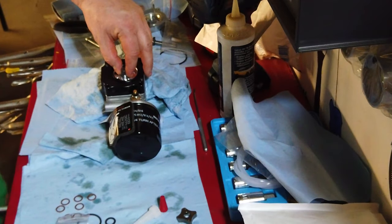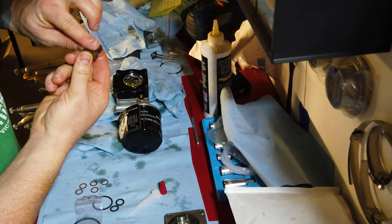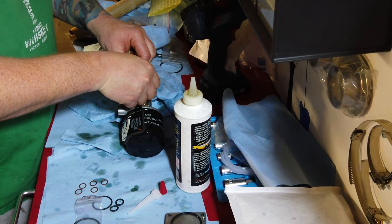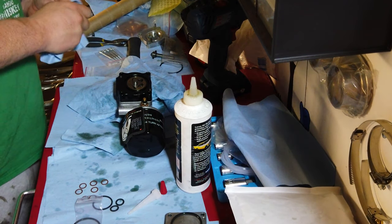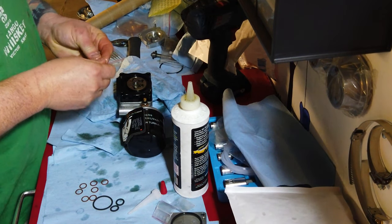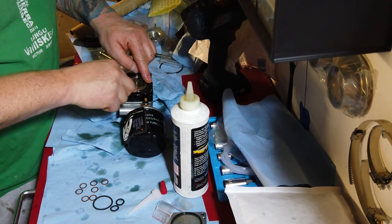Alright, put that in there. Put a little bit of oil on everything again. Now we'll take this secondary pump — we're reusing that piece — and fit that back over there until it drops in on that pin. I've cut three filters or so on this engine and found very little — just a few little speckles and sparkles here and there, but it's pretty clean. I'll try to keep that — keep it happy. We'll go for the next o-ring here, get some oil on it. O-rings on moving surfaces or that have to slide over things, you want to make sure they're oiled really well — these aren't really moving around but it doesn't hurt.